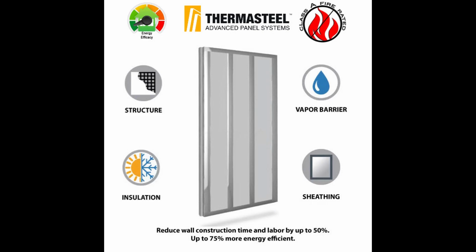Okay, we're going to take a look at the makeup of the ThermoSteel wall panel here. As you can see, it has 4 steel studs on both sides, and those do not go all the way through the insulation, so you don't create thermal bridging here. They're around 80 pounds per panel. They fit into a channel. They're very easy to put up, and you don't even have to use a vapor barrier on this if you don't like. So anyway, very valuable.